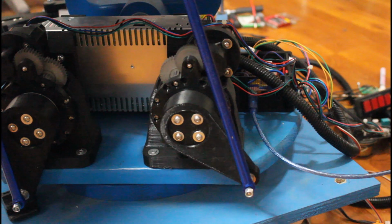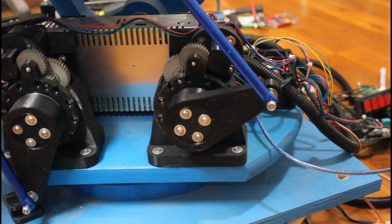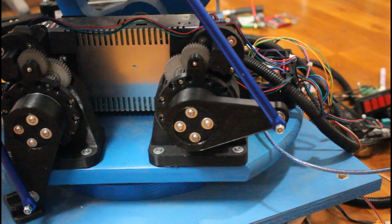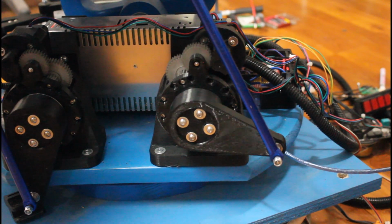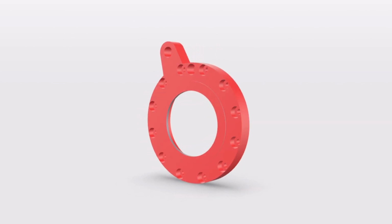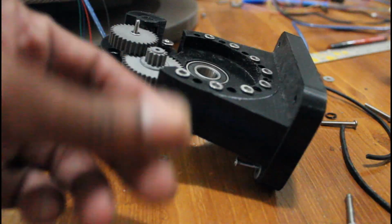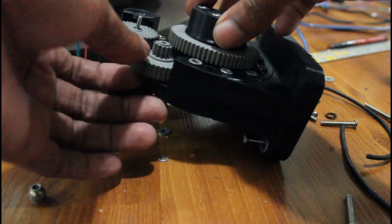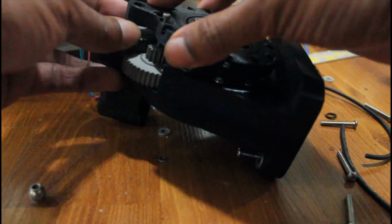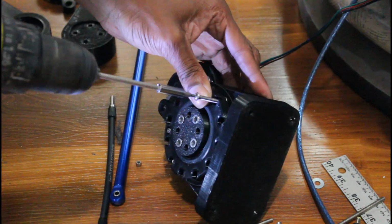Although the levers can easily lift each side of the head, I feel like at the base where each rod connects to the lever, it may break over time with the amount of stress imposed on it. I ultimately ended up redesigning and replacing our actuator cover to more securely hold back our bearing in place. The weight from the overall structure was also pulling on our main shaft. Once that was done, I reclosed both of my actuators. After securing this part, the bearing is held in place much more firmly.